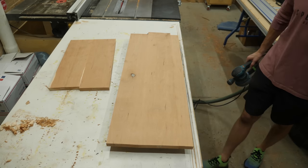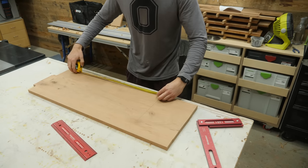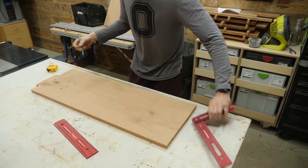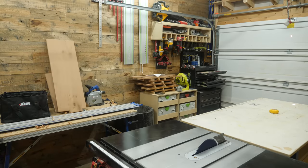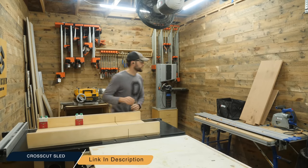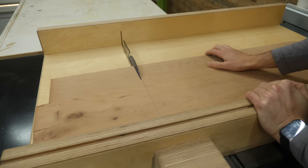I can now move along to cutting this panel up into its smaller components. The only thing I'm really concerned about at this stage is making sure the centerpiece — the top panel — is the correct size. This will result in the side pieces being longer than I need, but that's perfectly okay right now. I could cut this panel down on the track saw, but I want to show another way with my crosscut sled today. This is by far the most used table saw jig I have, and it's super easy to build. There's a full video and downloadable plans in the description.